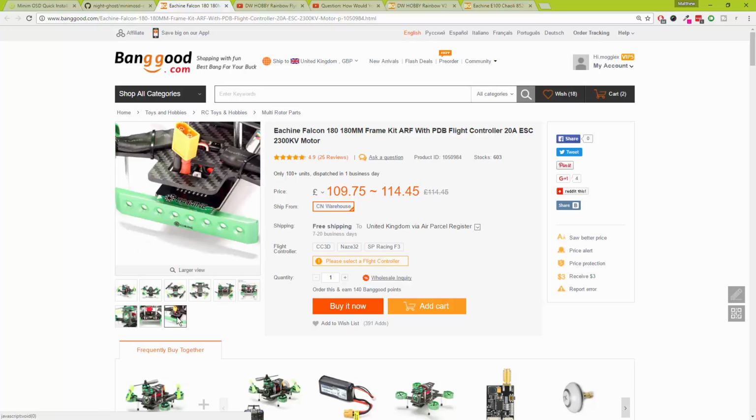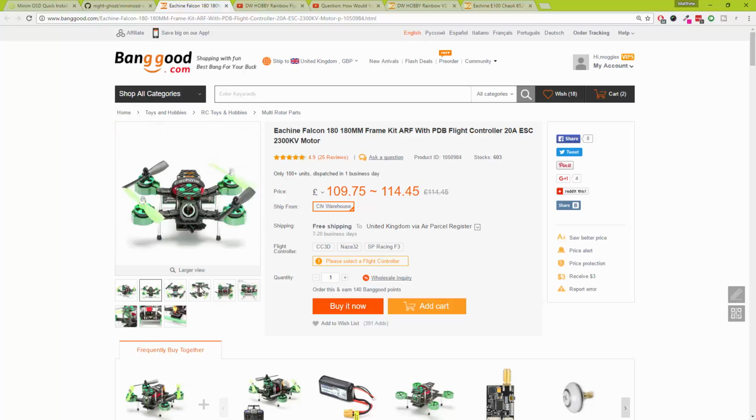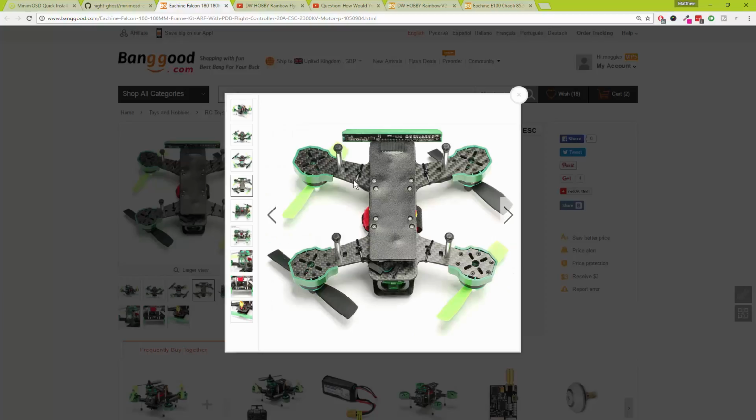Oh, and also that stupid LED bar on the back, where is it? It's here on my desk because I snapped it off on the second maiden. So yeah, great idea to have a little LED bar on the back of it, but absolutely fundamentally flawed because, let me just zoom in on this, can you see? The only thing which is holding that LED bar on is actually the solder joints there, all the way along that edge. So if you knock it a little bit, then that whole black plug just falls down. Yeah, nice and robust. Not!